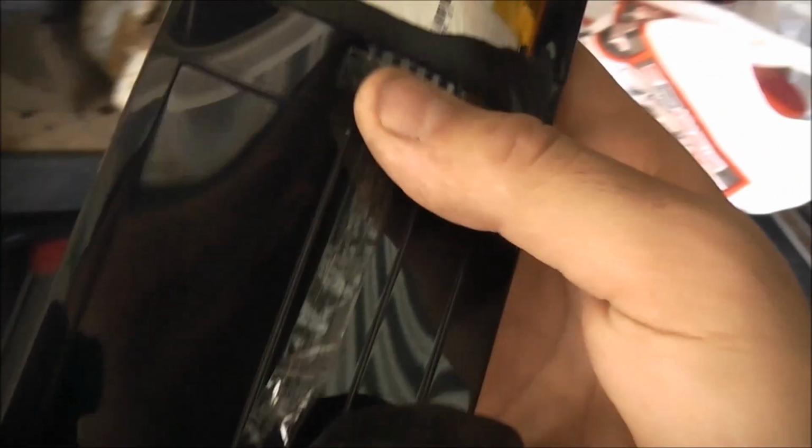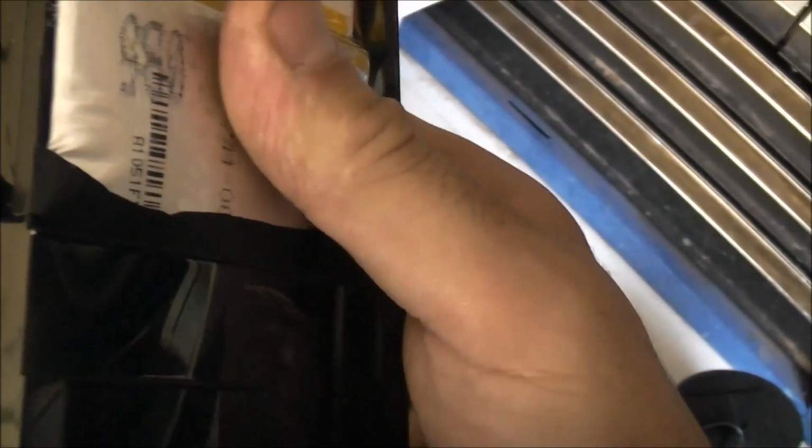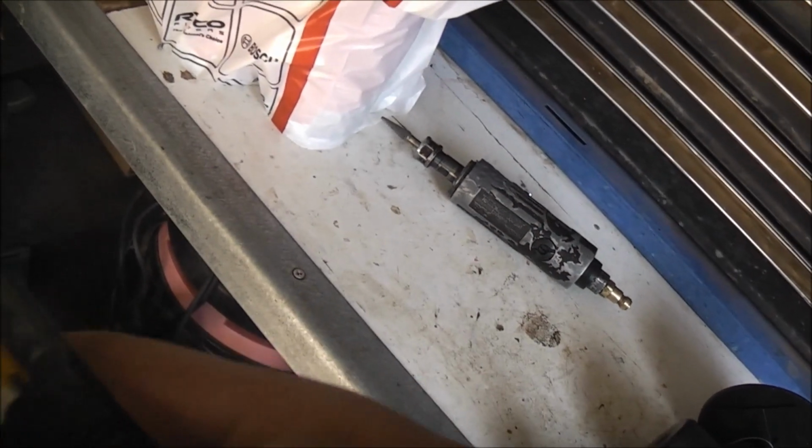Good old Crapple. 10.95 volts, 77.5 watt hour. I'm going to find out what the amp hours are. So I'm going to take these rubber feet off, get the screws off there, there and there. Unscrew this. These would be good Lipos for a power bank. Anyway, let's get this apart.